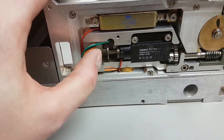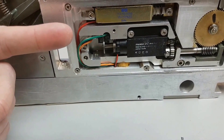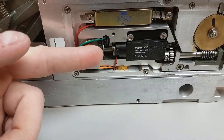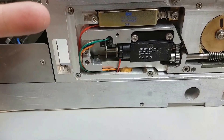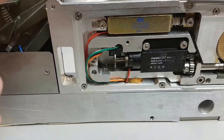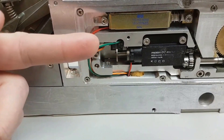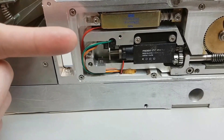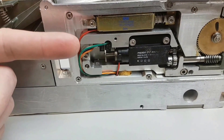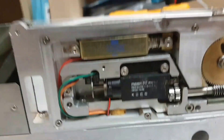The encoder wheel has to go forwards. It overshoots as soon as it trips the gate — it's overshooting and this just cruises on with the brake on at least half an extra revolution. So then I smack it in reverse and it goes back around and hits the stop. At which point I have to keep it held after it's hit the stop, because if I turn it off as soon as it hits the stop, it actually bounces back a third of the way from the force, because this is pretty fast.